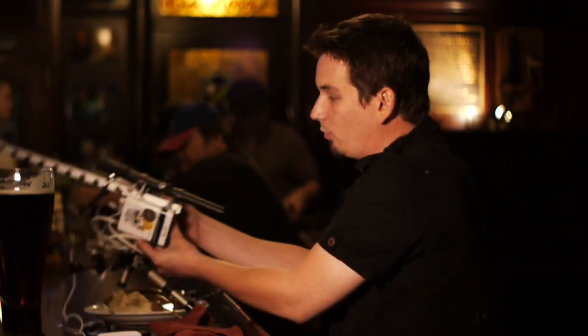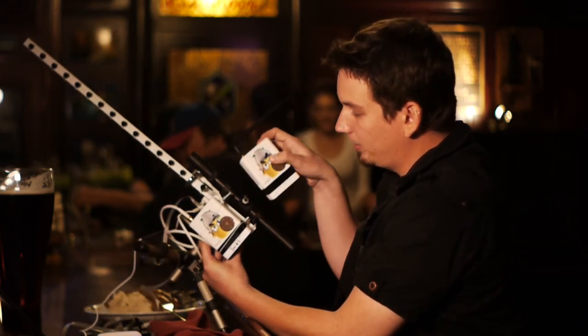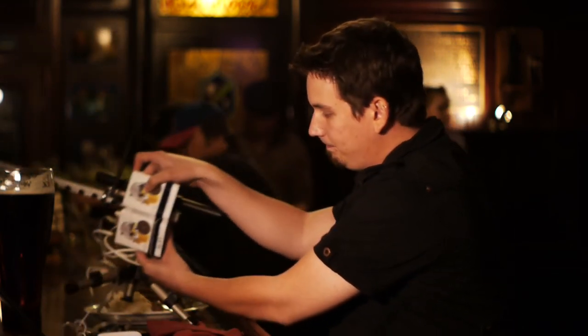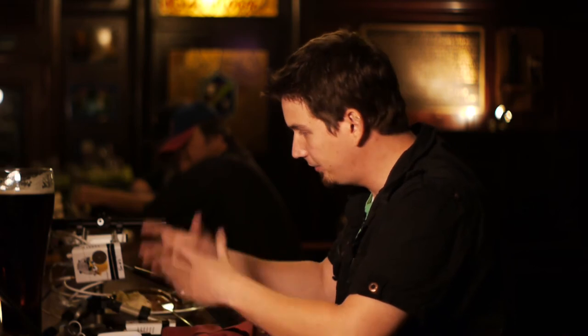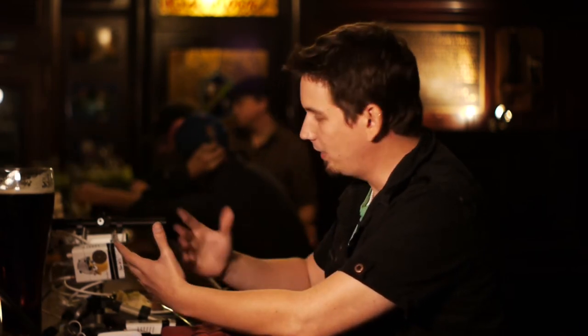And I'm really stoked about the idea, since we've moved essentially where the clients connect on the machine, of taking a rig like this and a second pineapple and piggybacking them together, one connecting to the internet and the other providing the Karma to everybody else. I actually tried to create a virtual access point, and it turns out that while you can create another AP in here with airmon-ng and stuff, it's only going to go into monitor mode, not master mode. Unfortunately, the radio is actually uno radio, or eins radio, I guess we would say here in the Baltic. But that's the direction of the pineapple.